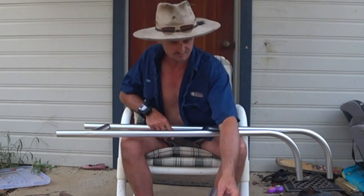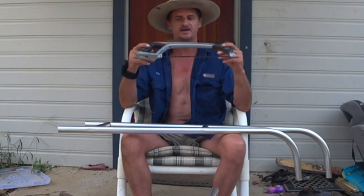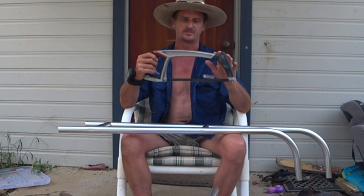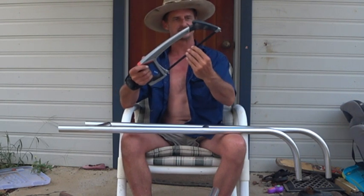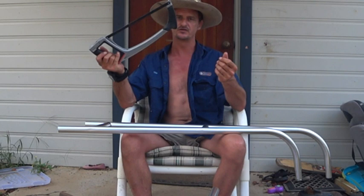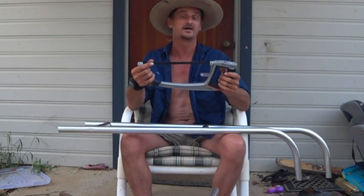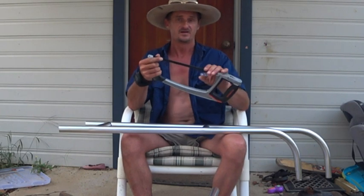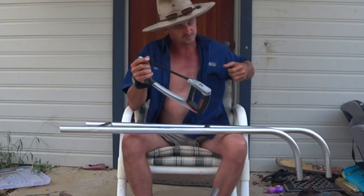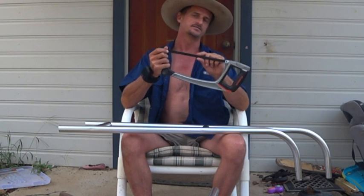Here's another little tip — I learned this many years ago. I bought this hacksaw, it's about 30 bucks and clips the blades in nice and tight. Most saws — wood saws and such, I'm from the construction industry originally — you cut down with the blade facing towards you. But if you want to do finer work, turn your blade backwards and give it a go.